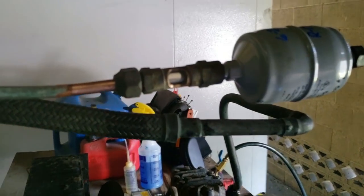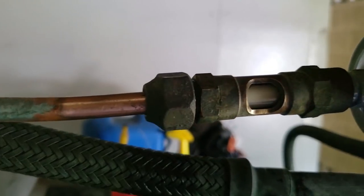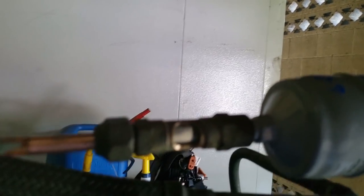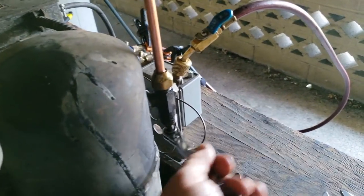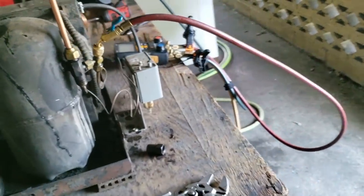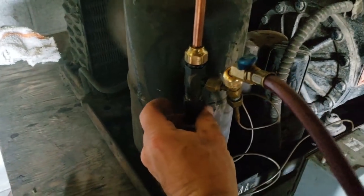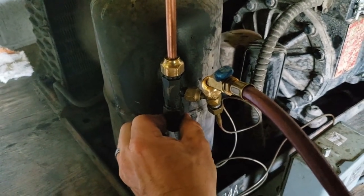Go ahead and release her here. There goes the mad dash. That's the coolest thing in the world — watch that solid sight glass. Nothing worse than seeing an empty one. Don't forget: you back that out all the way and you're going to put down your pressure switch. Just pointers for the new guys — these are mistakes that I've made several times. Usually I catch them before I go, but I'm not going to say I've done every one of these and not forgotten them.